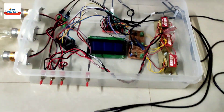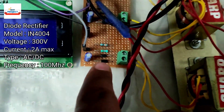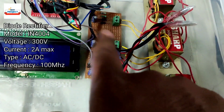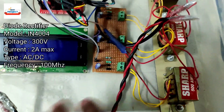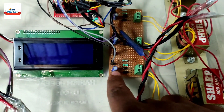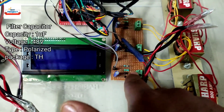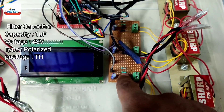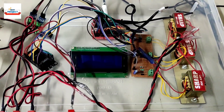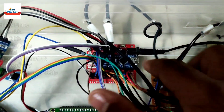To get 12 volts, we are providing it to rectifier circuitry — you can see here. There are three of the same circuits for three voltages. It is connected to a rectifier system and then to a capacitor so that we can get stable voltage. There are also two resistors connected here to measure voltages from 12 volts to 5 volts using a voltage divider circuit.